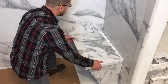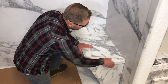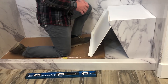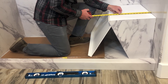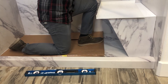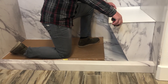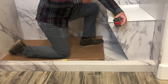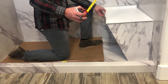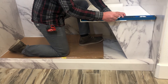Next, dry fit the top cap onto the bench. Check under the side edge of the top panel for any gap between the panel and the block, and scribe and cut the opposite side of the panel to remove the gap. Take the top cap, turn it upside down, and mark from the inner lip of the panel to your measured distance. Repeat this process for a few locations on the bench, making sure each marking location corresponds with the correct location such as the front or back of the seat. Draw a line between all the marks and cut off the excess panel.